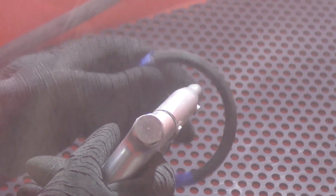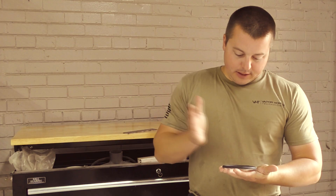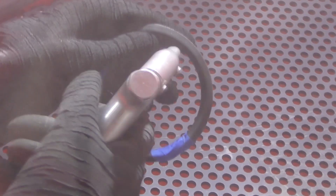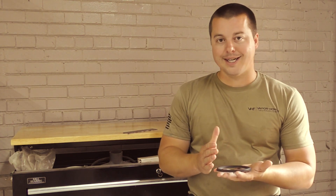You can see some of the blasting footage, but you can also see a major difference on the part itself with the wet versus dry comparison. The dry side is much more aggressive — you can definitely see some of the underlayment, some of the membrane holding the rubber together, more so than the wet blast side. That's number one. Number two is also the texture and roughness difference — there's a major visual difference on the dry side.